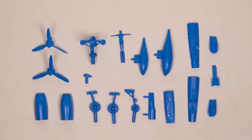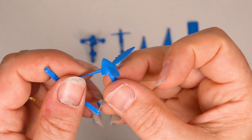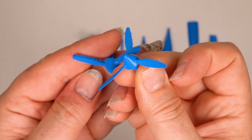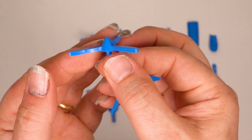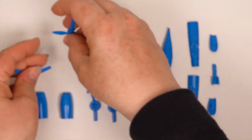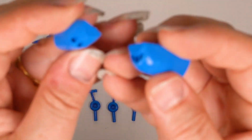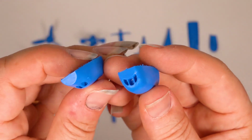And here are the results of my resin printing. I originally printed the props as per the 3D model. They came out perfectly, but too thin for casting. So I've printed them thicker, and will use them to make cold cure moulds and metal masters, which I'll rework by hand. I have to convert some of the other parts to metal masters anyway, so it's no hardship. The nacelle variants need duplicating and detailing, which is pretty straightforward with cold cure moulds.